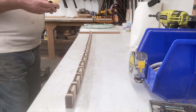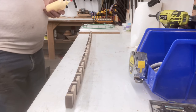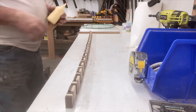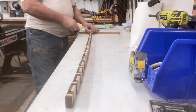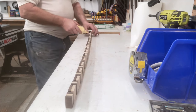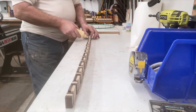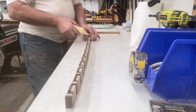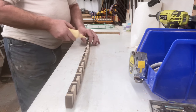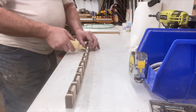Well, I've taken video of this before with my GoPro in a time-lapse mode, but we'll show you. Harbor Freight, little squeeze bottle, which I transfer glue back into. And then I just give it a little squeeze, each little location between each joint. This joint's laid out on half-inch wide masking tape, blue painter's tape. I order it up on Amazon. And I just put a little squirt. Don't worry about spreading it around. It'll get squeezed. Got a little squeeze out top and bottom of the ring.